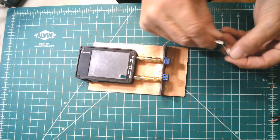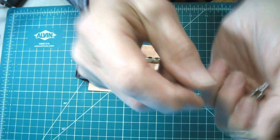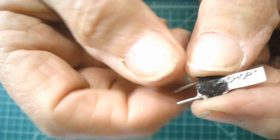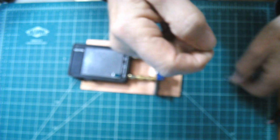And then in the process of calibrating it, you have to put a termination there, so I've made all the appropriate terminations on little jumpers here. For instance, here is a short circuit. Let me get a close-up of it here. So that's a short circuit. You can see I just put a label there, so the wires just go in and go around like that.